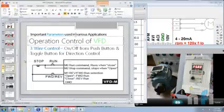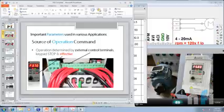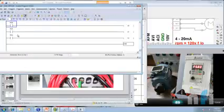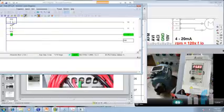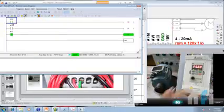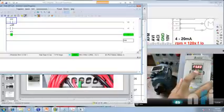This is one of the control modes. So we have done operation determined by external control terminals. Keypad stop is effective. It means the motor can be stopped by the keypad as well. So if I show you here, if I turn on this one, the motor is on. Now when I want to turn off the motor, I can press this one. You see, the motor is off.